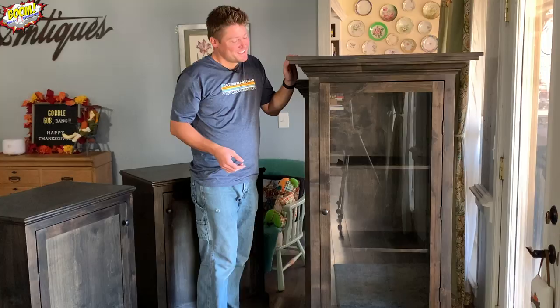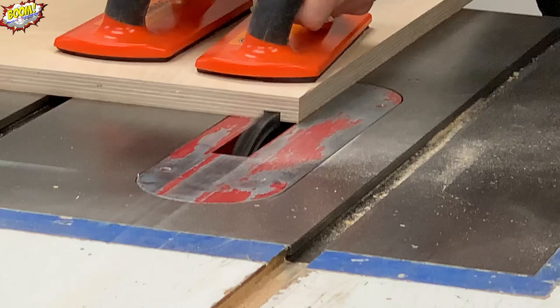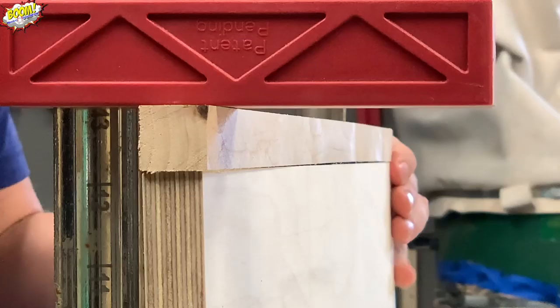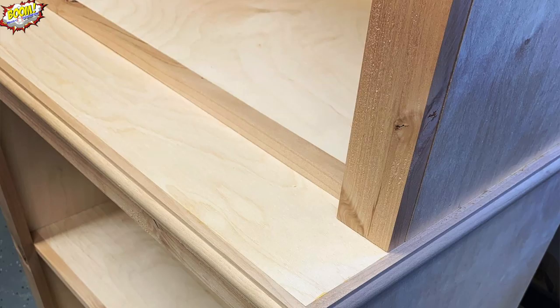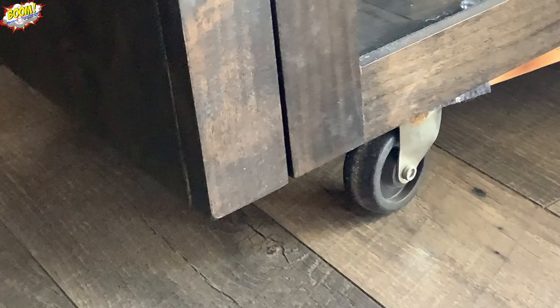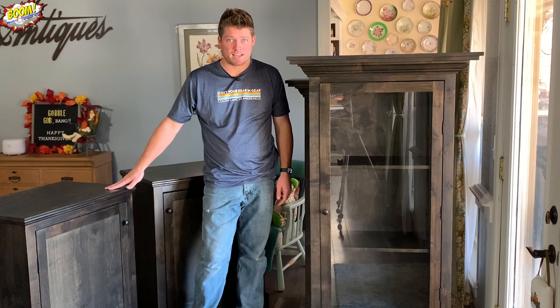The big cabinet on top is a little more narrow in depth. It is also made from plywood on the sides, with half-inch plywood on the back set in a dado and groove all the way around. The shelves are fixed and edge banded. The bottom shelf is set back at the same depth as the normal shelves because this is an inset door, just like the lower cabinet. When you shut it, the face frame of the door has a slight reveal of about an eighth of an inch — I designed it to just barely clear the top of the cabinet by an eighth of an inch when you open it.